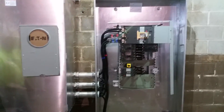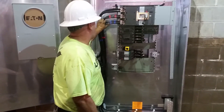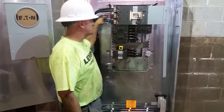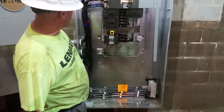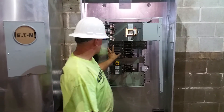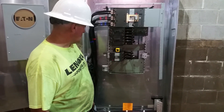Here's your thousand amp main. This is 350 MCM — it's actually rated for 1050 amps; I went a little over, just because. So that's about it. There's our neutrals. So we have a 200 amp — that's going to be a sub panel somewhere — another one, another one. Then I got a little hundred in here. And that's it, man.